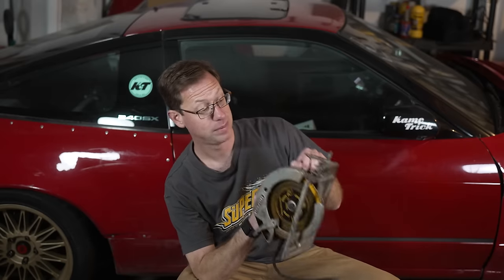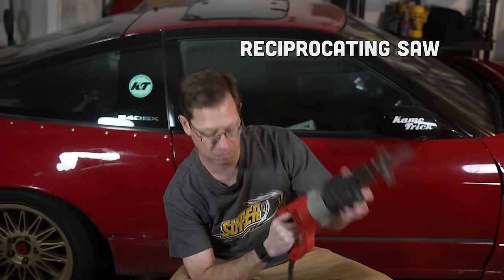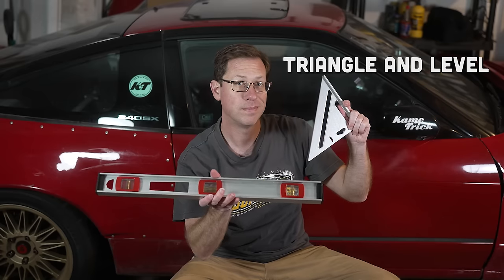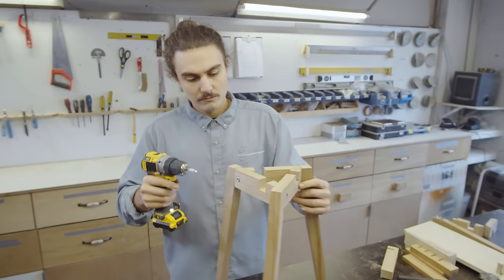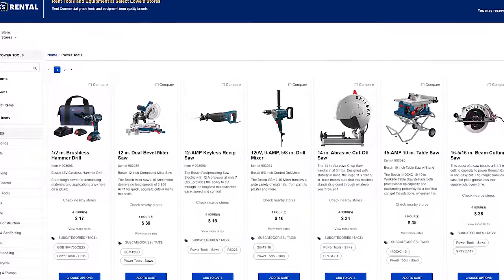The second challenge is tools. While it's possible to build a rig with a hand saw, hammer, and nails, ideally you'll want an electric saw for cutting boards — a miter saw, circular saw, or sawzall — plus a drill with bits and screwdriver heads for making pilot holes and fastening boards together, and a level and a t-square to get everything flat and squared up. A corner clamp jig can also help assemble boards at nice 90-degree angles. If you already have tools and know how to use them, that's a huge plus. If not, hardware stores will often rent tools by the day, or you can borrow from a friend.